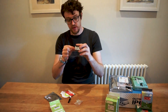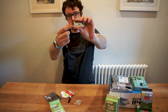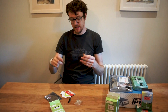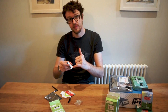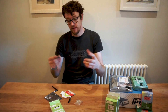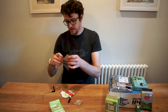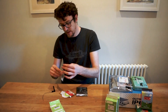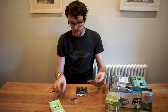On the board you'll see markings for 'ext' and 'int' — you need to move an inductor between those pads to change from the internal to the external antenna. When you receive this it will be configured to use the internal antenna, and if you want to use an external antenna you just move the inductor from the int pad to the ext pad. That's the LoRa node pHAT — we'll put loads of information in the links below the video.